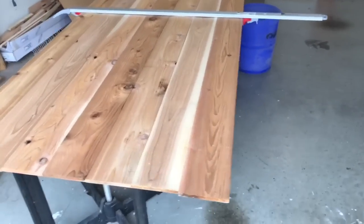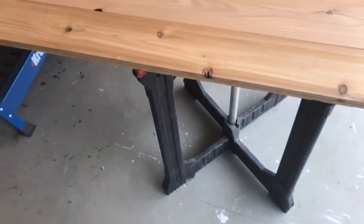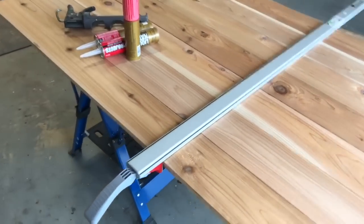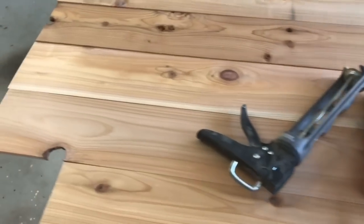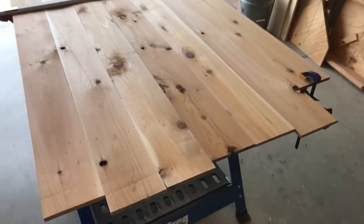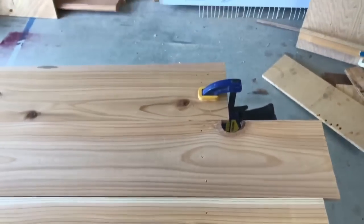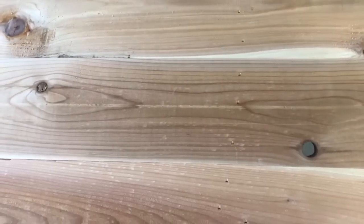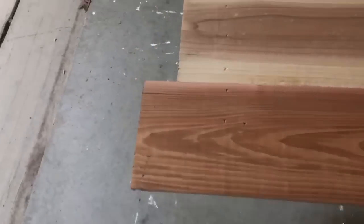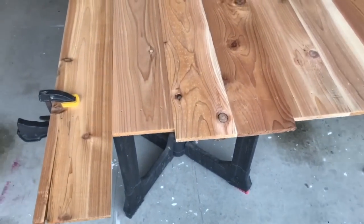I've picked out the wood and lined it up on top of the piece of plywood. You can see this has a little bit of split, so that will be our overcut — about an inch overcut on this side, and about half a plank overhang. I have a clamp keeping them tight. I'm going to use liquid nails to attach it to the piece of plywood. I put my dabs of glue down — I have about four minutes so I've got to move fast. After putting the boards in and applying the glue, I come in and put a row of brad nails down. That edge is going to be covered by a decorative piece or sawed off after the rough cut. We've got our clamp holding that down, and a row of brad nails along the bottom as well. Now all we do is trim off the excess on the end and we'll have one side done.